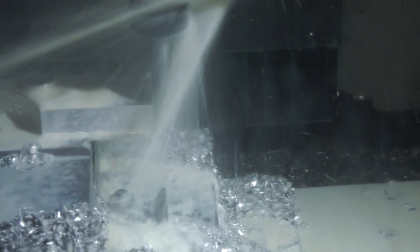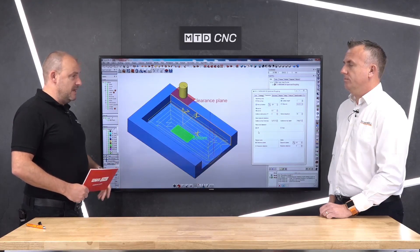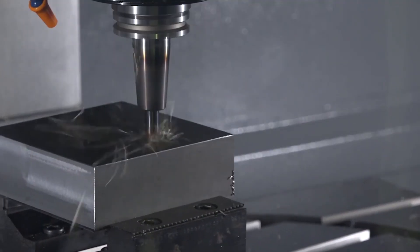Let's talk about four basic machines: a basic turning centre, a two-axis lathe, a three-axis machining centre. Let's talk about some of the strategies that will help. Let's talk about roughing, for example — how can you push a machine more to its limits in that area? Roughing in HyperMill is quite a large subject; it's very flexible so you can pick the appropriate strategy depending on the application and the material. For something like steel — a quite hard, tough material — that's where you want to utilize what we call HyperMill MAX machining roughing, which is a trochoidal-style toolpath.